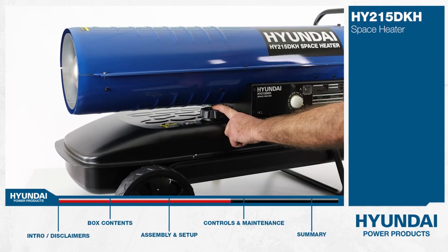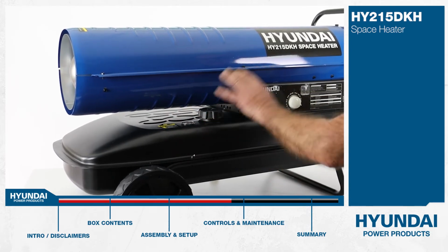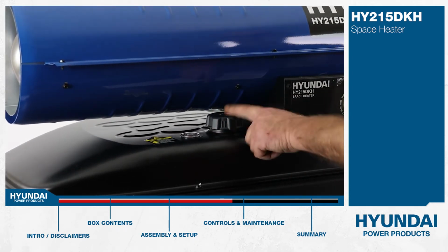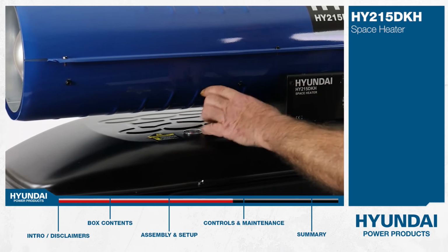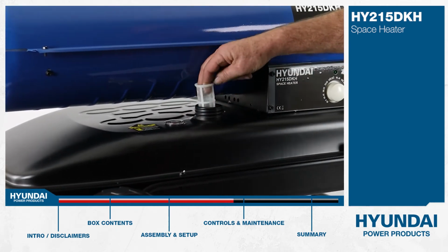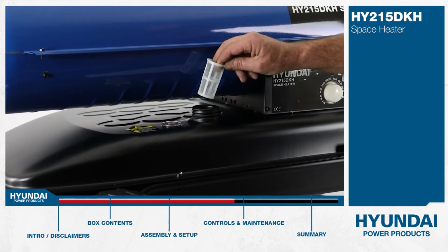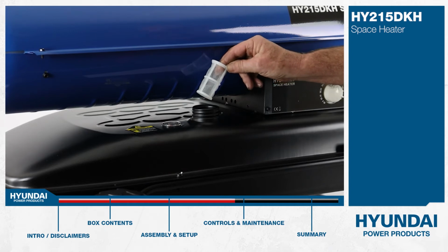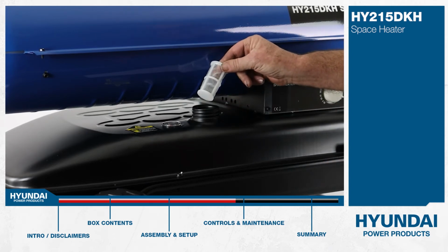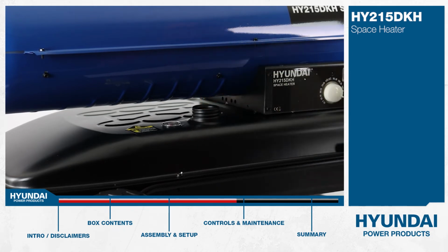Now when filling with fuel, obviously initially it's going to be cold, but when refilling with fuel, always let the machine cool down completely before putting fuel in. So fuel filler here, unscrew the cap anti-clockwise, and you will notice that there is a fuel strainer in the tank here. Leave this in the tank even when filling, because it will collect any debris that might be in your fuel cans. And again, if you do notice any debris in there, give it a clean from time to time to stop it building up.